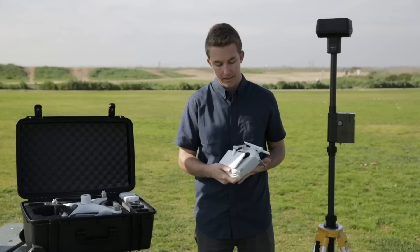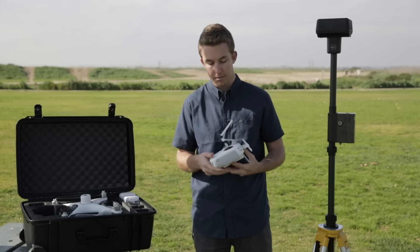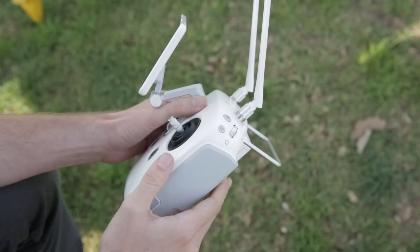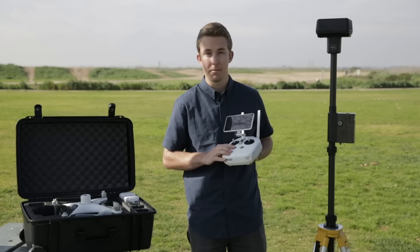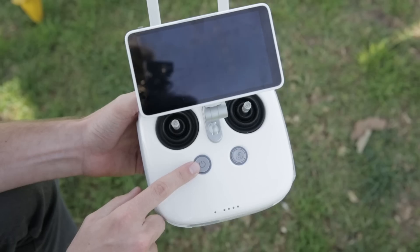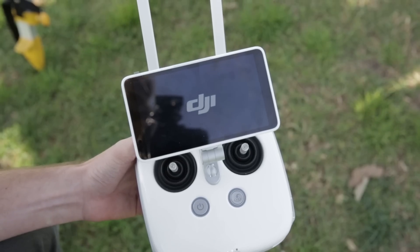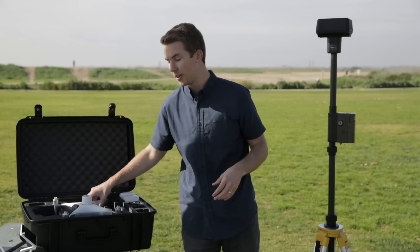Replace the cover and then pull up the screen. It's a nice high-brightness crystal sky screen that comes with all of the RTK units. Then adjust the antennas — bring these to about a 45-degree angle so that when you're holding them they're faced straight up in the air. To turn everything on, press the power button twice and then hold for three seconds, just like we did with the mobile base station. You'll hear it beep as well as see the DJI logo appear on the screen.